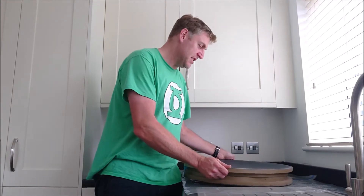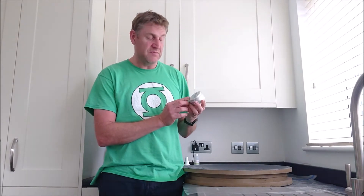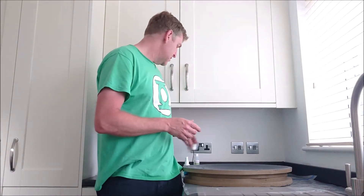So the next stage of the process is to use a release agent to basically stop the carbon fibre disc cover sticking into the mould when it comes to trying to pull it out. Traditionally we use something called a wax, which is basically like a beeswax or something you would maybe polish a table with. The Easy Lease from Easy Composites is an easy release agent — a very thin fluid which puts a small coating, like a non-stick frying pan coating, on the surface of the mould so it's going to stop everything sticking to it and hopefully release off.